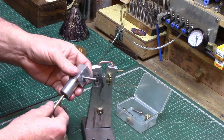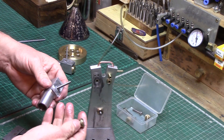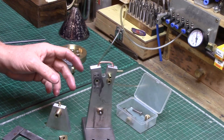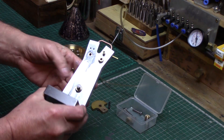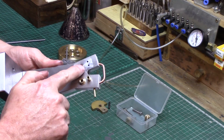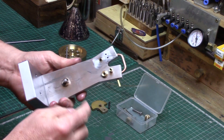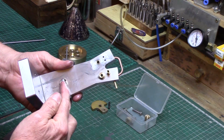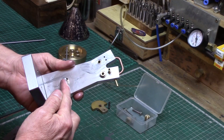I couldn't figure out exactly what was going on. I remeasured everything - all my lengths, my shafts, the pistons, the stroke - everything seemed normal to my drawings. I've only found it today, it's Monday, so I spent all weekend getting nowhere. Then today I went back to my original drawings and checked everything, and I realised my mistake. What I'd done is when I marked out the positions for the pivot point, for some unknown reason I was actually three millimeters lower than I should be. I can only imagine I took the measurement from the axle shaft, which obviously means six millimeters, so I took away 50% of that - three millimeters - and marked my positions.